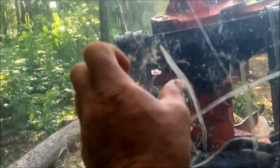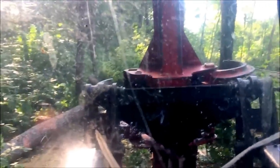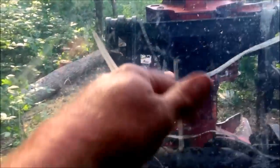Now you can use this thing if you lose your grip, or loosen your grip. You can give him a little push and help him roll, kind of like when you're cutting timber off the stump, you know. But the good thing about this thing is just because the tree's going over don't mean your job's done. You can fight that thing, manipulate it, let your grip loose a little and push, and that butt will roll up inside. All that steel's all scoured and smooth, so it'll spin inside that steel, and you can make the treetop do what you need it to do.